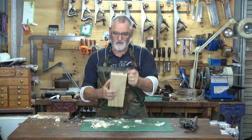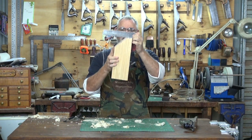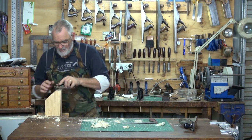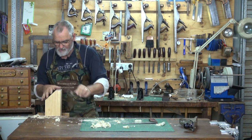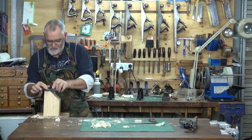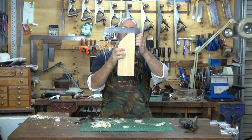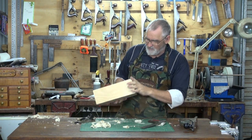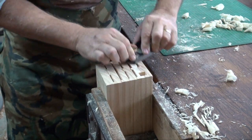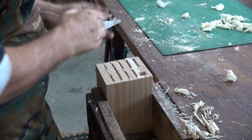Make sure it's square. That's good there. We know that's good there. A little bit on the ridge here — only a smidgen. I reckon three passes each way. And there you have it, nice and square. Now we do the same to the bottom. Got it in the vise. Start at the high point first, which is up the back here. And we could get tear out, so we put a little bit of a chamfer on both sides.